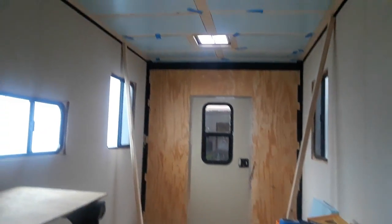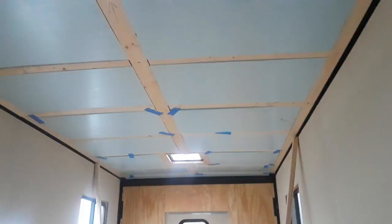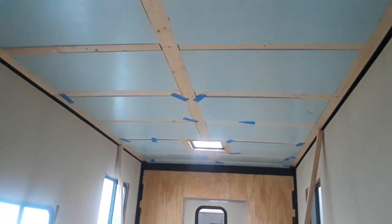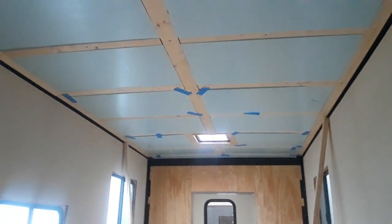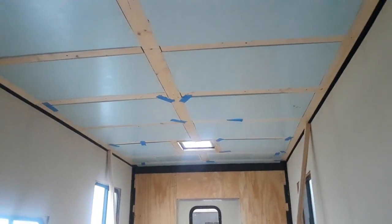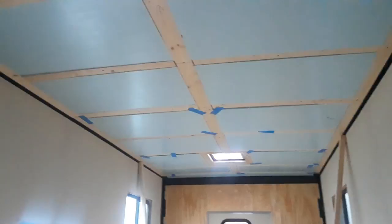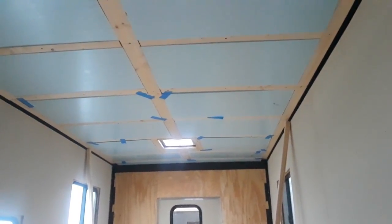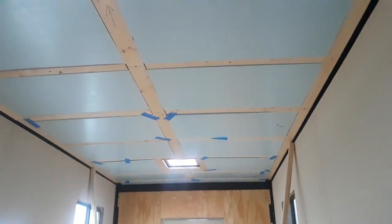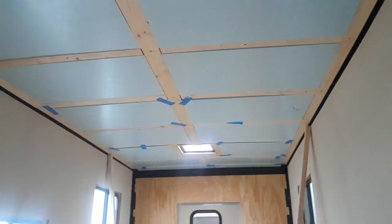So this is just a quick episode to let you know what we did. The furring strips that went up here were really simple — not difficult at all. I used a Gorilla Glue construction adhesive to stick them to the metal cross bars, and I ran one screw into each board on either side of that center board. That one screw was just enough to hold it in place until the Gorilla Glue construction adhesive took over. You can tug on those all you want — they are not coming down.